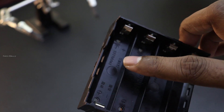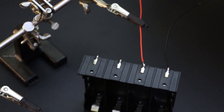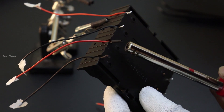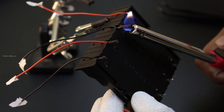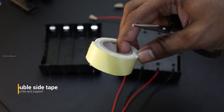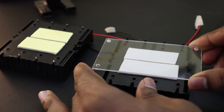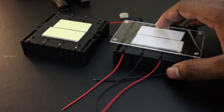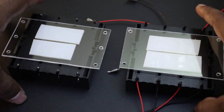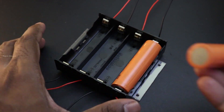The holder itself has markings for the series connections to mount the batteries. First, I soldered the 2P parallel wire connection. I used double tape to stick the acrylic sheet with the battery holder. Before soldering these two holders, I have installed the batteries at the bottom holder.